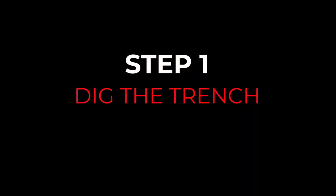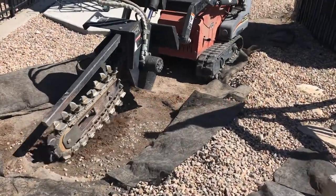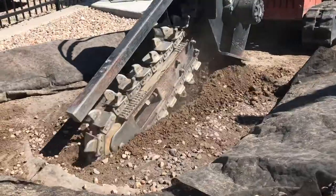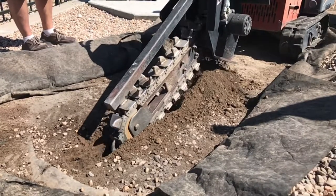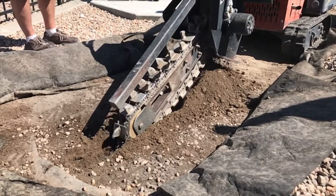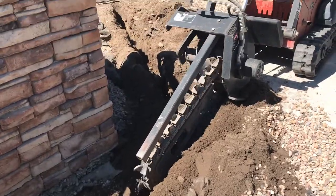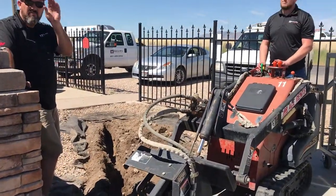It's really important to have someone with experience and a certification. We are gas certified. Step one: we are digging a trench to lay the gas pipe underground. It needs to be two feet deep, maybe even up to 30 inches. You don't have to follow a straight line — you can curve around any structure, as the pipe is fairly flexible.